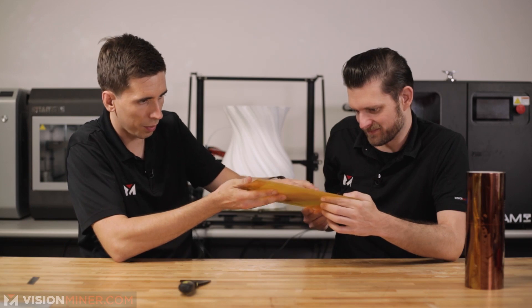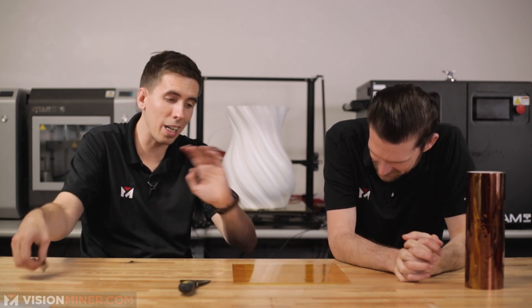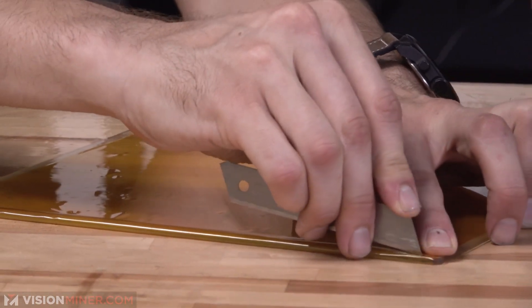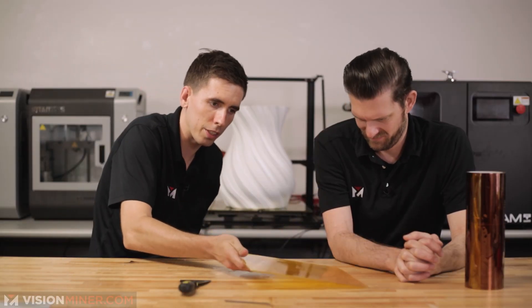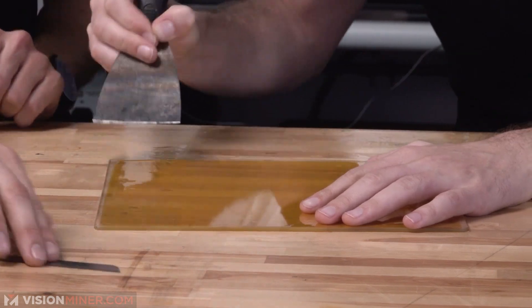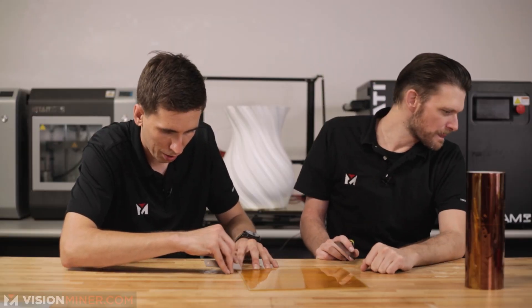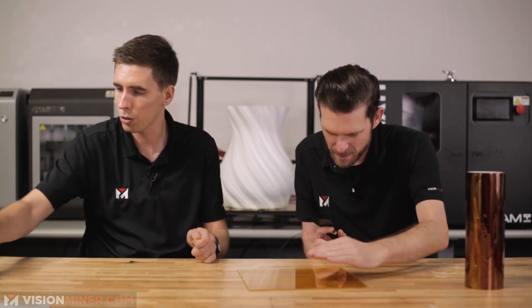There are bubbles all over the place — it's just kind of a pain. What I'll usually end up doing is cutting along the very edge once it's fitted and flat. That way I don't have to worry about the bottom parts and I have a perfectly fitted piece of Kapton. Then do your best to get all those bubbles out. If you start from the edge it sort of bows up, so start inside from the edge. You'll get a pretty clean edge there — hopefully you're not printing that close to the edge anyway.